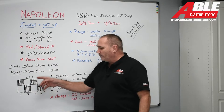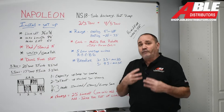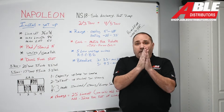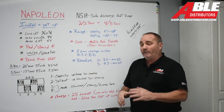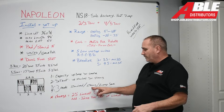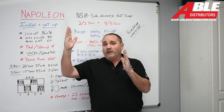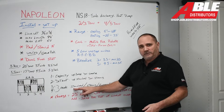Dip switches three and four — the instruction manual is very complete and shows you everything you need to know. Depending on how you move dip switches three and four, you've got three settings: Standard, which is how it comes from the factory; Strong, which means it reaches its modulation rate faster — if you're putting this on a Unico or Space Pack, absolutely put it in strong; and Economy/energy-save mode, which starts slow to try to satisfy the thermostat before modulating all the way up, saving energy. Honestly, I'd go either standard or strong.